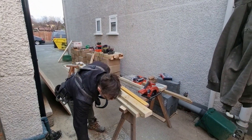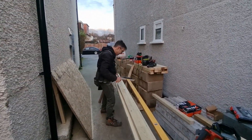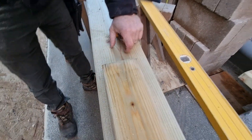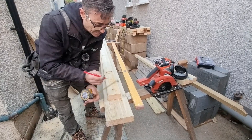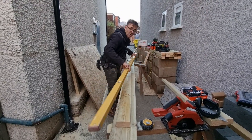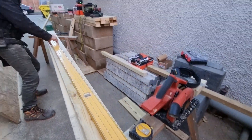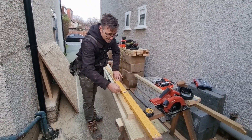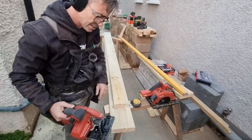Then what I want to do is establish my fall, which is really easy. I want to finish at 10 millimetres on the narrowest point, so I'm just going to put a 10 millimetre mark on here and a little line there. Then at the other end of the timber I mark the centre line — in this case it's around 47mm. Mark the centre line there, then take a straight edge and because it's only two metres long I can use a spirit level or straight edge. Join those marks up and pencil it through, then quickly rip that down and that forms a fall furring. I'm going to cut straight down the middle of the line — not to one side or the other, straight down the middle.